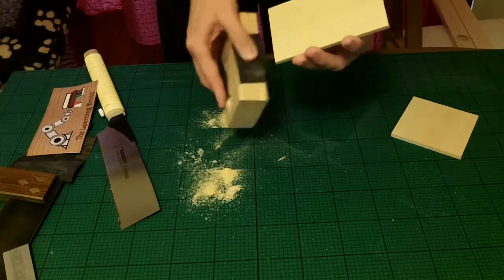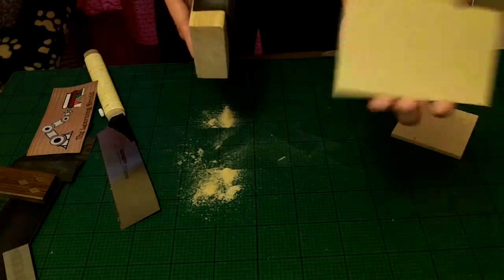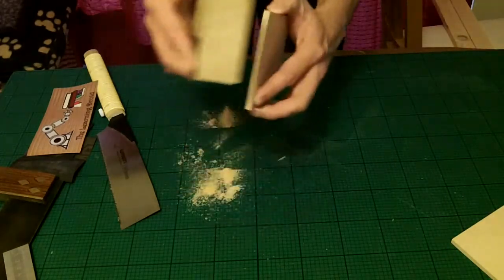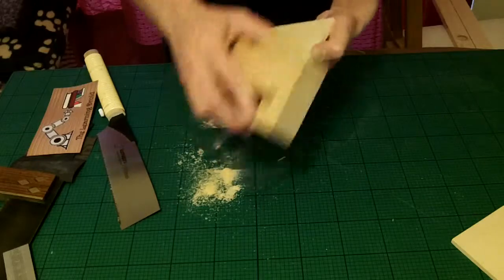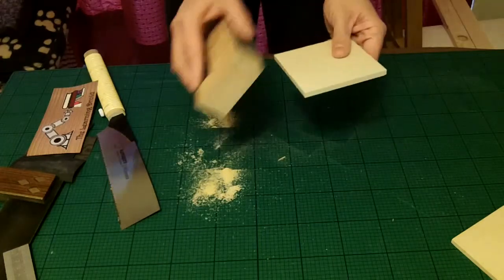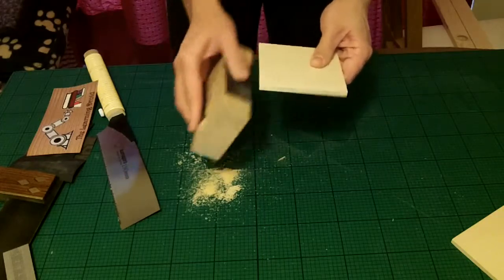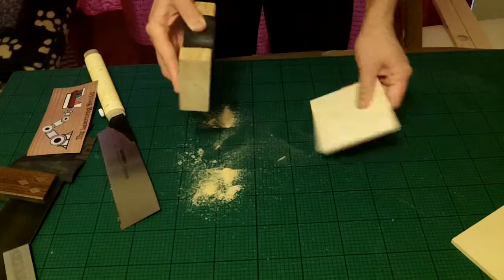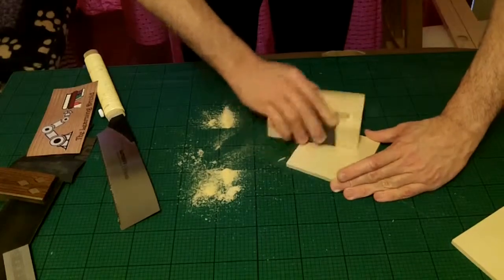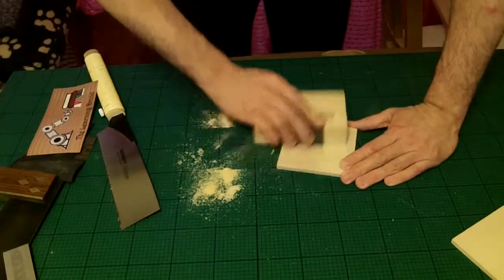always moving with the grain. See, we take them out so that they go away. Slight angle to one of those cuts which happened before, because I actually cut it at an angle intentionally. Once again, slight ripping. I'm just going to sand that very gently with 400 grit, nothing really much rougher than 400 grit. Sand it very gently just to get those rips to go away. Once again, with the basswood, a nice little bit of sanding with 400 grit on top. And again, in line with the grain of the wood.